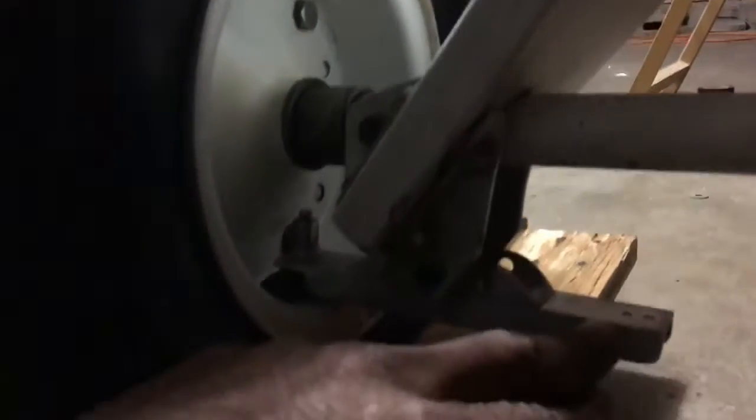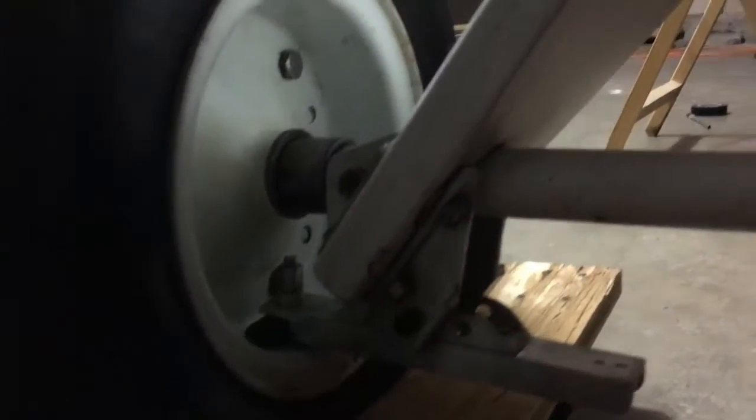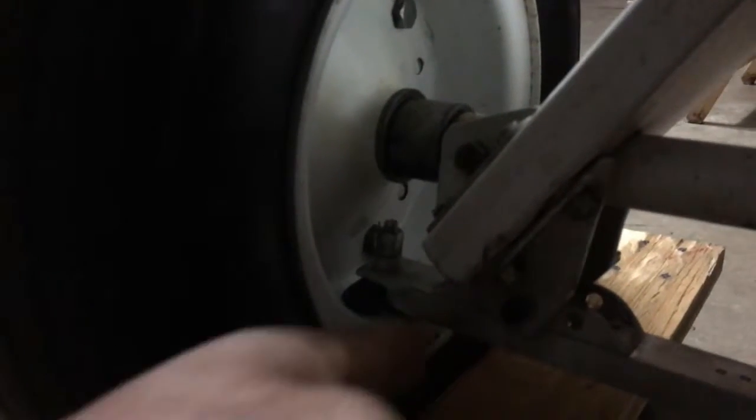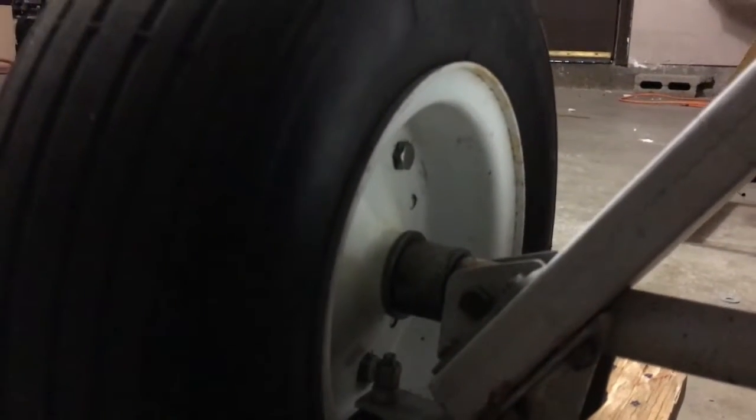Once I put that in, it should come out pretty good. I also have my brakes hooked up. Well, not completed yet, but I made some friction brakes. As you can see down here, there'll be a cable coming up to the cockpit with a motorcycle brake lever, and it'll pull these up. So you can see they push down. I used a bicycle brake pad on the end of this lever here, and it provides quite a bit of friction, which should be good to stop it.